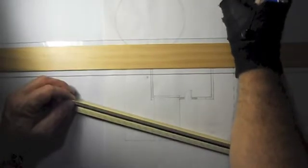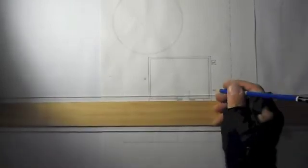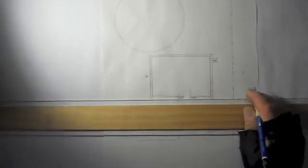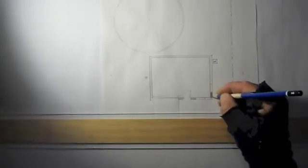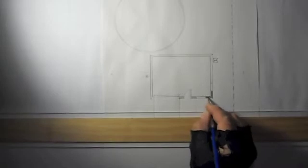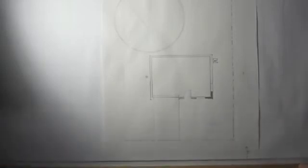Now here we have the most simple of base maps on an 11 by 17 sheet of paper, but it's accurate. It's proportional to the measurements. We know where everything is on this. We can also now go back and add more windows as we would measure them from the corner. We could keep adding windows. If there's a picture window there and we measured that there was another window over here at a certain distance, we would put that in, and then we would fill in this square, because that's a solid wall, with pencil. And we go all around the house doing that until we're done. Putting in all the windows. There's probably a back door and those things. But we have a good start on our base map now.